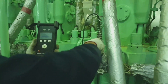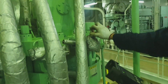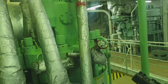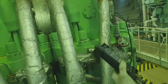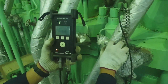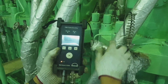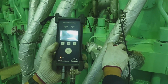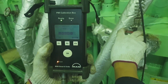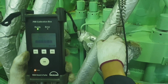At the same time the data will be saved. How do you know it is saved? On the monitor it will be shown — the calibration box shows 'Ready.' That means it is ready for the next measuring on the next cylinder. Here at unit number 6, fully open the indicator valve, then press the OK button and it will start recording the pressure diagram.